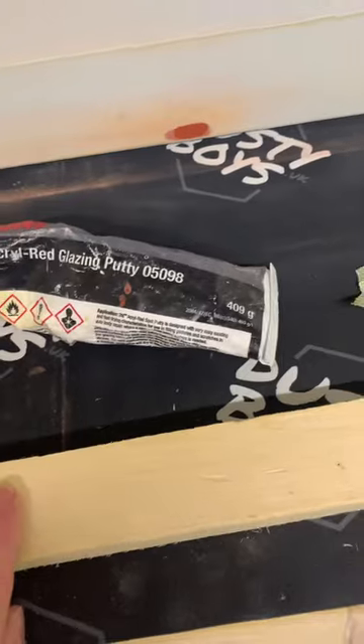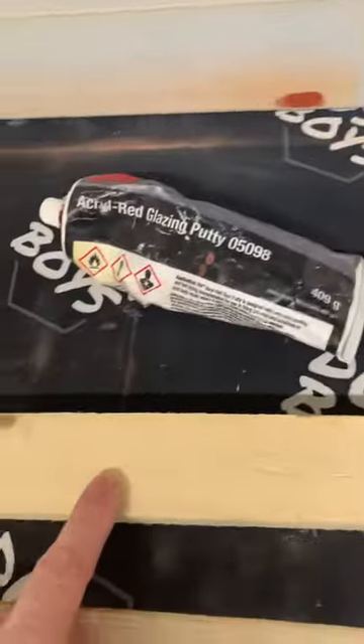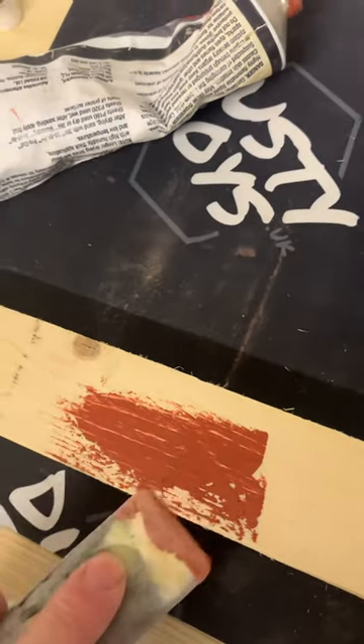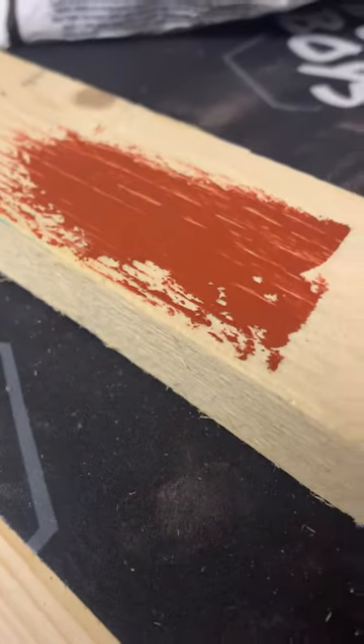What I'm going to do is just give you a bit of an experimentation, filling different cracks that I've put into my test piece of wood. It's a red colour, which if you're doing a dark colour — as I am on these particular doors — it's not too much of an issue. It does dry incredibly quickly, so you only want to put a tiny amount on for surface imperfections in the wood grain. As you can see, it kind of levels that out quite nicely.